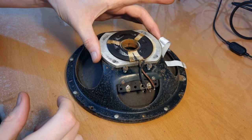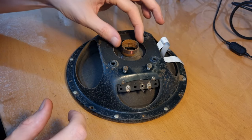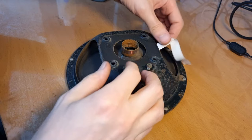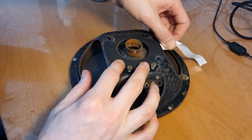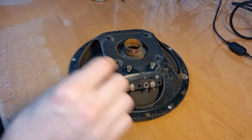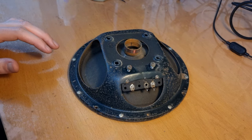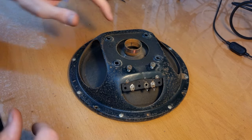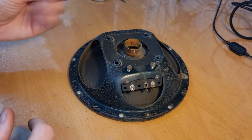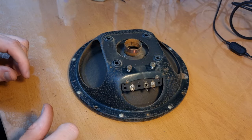And then normally, this entire assembly should come off. Right. And see, now we clearly see here the voice coil and the cone, because now, yeah, now it's gonna get a bit delicate. So I'm just gonna now clean this very carefully and then remove the paint as much as possible, and then I'll get back to you. I won't film it because it will take too much time, because I really want to take my time for this and not rush it and not damage the cone, which is still in perfect condition.